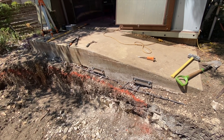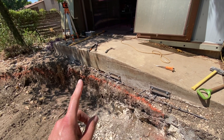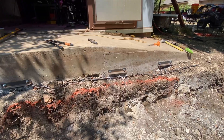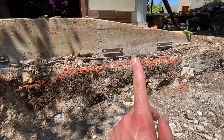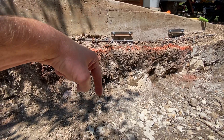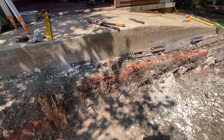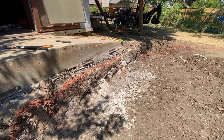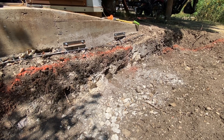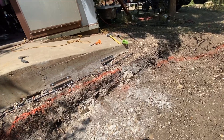Right here we've got three brackets mounted on the ramp into the cement. I'm going to be welding the steel wall to those brackets. All these little rebar spikes are vertical, pounded about two feet down — below even the point where I dug. All those verticals are welded to a common horizontal, and that is holding the soil under the workshop. There were some boulders here; I had to break out my hammer drill and drill through those. That sure makes you think about stonework — I don't know how they built the pyramids, but I doubt it was with copper tools.